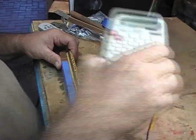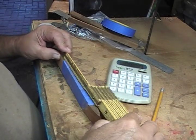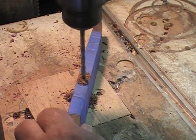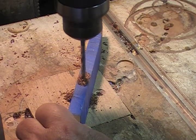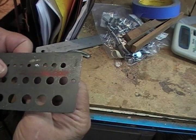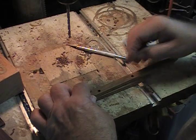I'll use three inches, and then 1.618 times three gives the second measurement. You start with the unknown from the tip going back — you'll see it on the directions. I take it over and drill a hole dead center through the strips, drilling all four. The holes are exactly three inches apart. Here's the beauty: no matter what you do, that first number — three — stays with you as your known dimension.